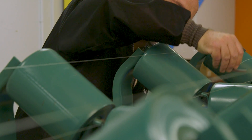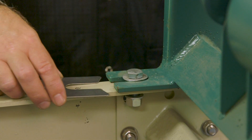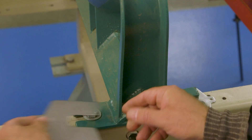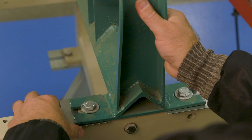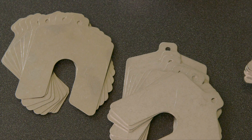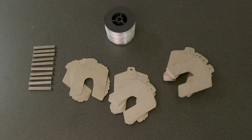It also determines the transverse or side-to-side alignment of the idlers is correct. Shims can be added or removed to adjust the heights to achieve the target alignment. Typical motor mount shims in different thicknesses can be used to make these adjustments. These shims, often made of stainless steel, can be purchased at most bearing houses around the world. They can be purchased in bulk by size and thickness, or in a shim pack with an assortment of thicknesses in one convenient carrying case.